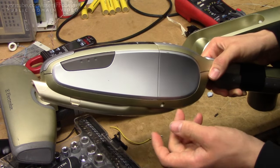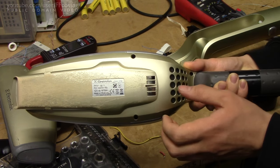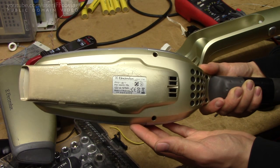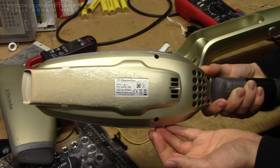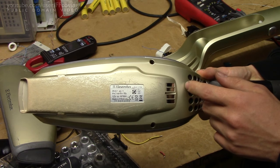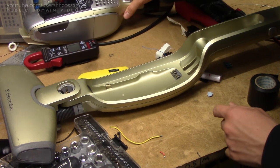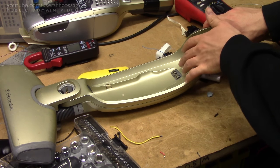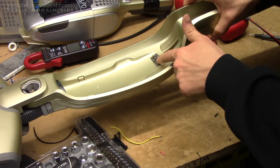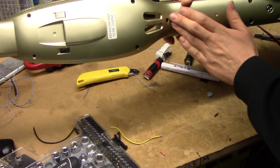The way it was connected, it just used an extra connector and would charge the battery through the power output connector. Since the protection circuit I'm using actually has a connector for the charger — and also protects from over-voltage during charging — I've just reused that low mode connector to connect to the DC plug on the back. So we've got separate charging and power output connectors, and one of these pins runs straight to this plug.